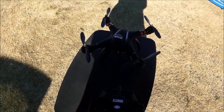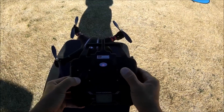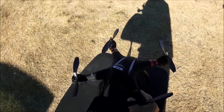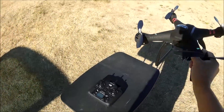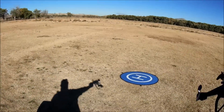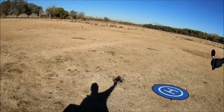The green light is still flashing, so now we do the compass calibration. Left stick to the bottom and left, pitch stick to the top and right — that puts it into calibration sequence mode. This one is a little different: the instruction says to hold one of the arms and wave the quadcopter over the remote control in a figure-eight pattern. Let's go ahead and do that — a big figure-eight infinity design — and it should give out a total of five beeps.